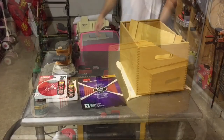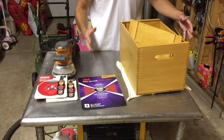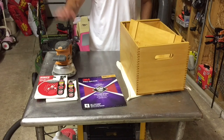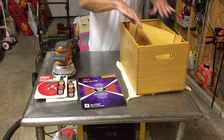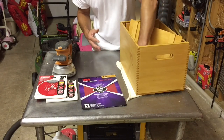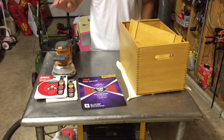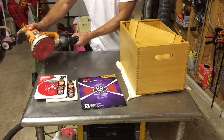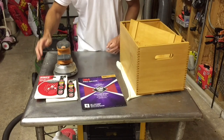Before I glue up, I like to sand the inside panels. I'll mark which ones are the outside, lay my boards out, and use my random orbital disc sander to sand all these inside panels. Because once it's together and glued up, it's difficult to get in — especially in the corners — and get a nice smooth finish. I use pads with holes in them so I can hook up my dust vac and collect all those fine particles so I don't breathe them.